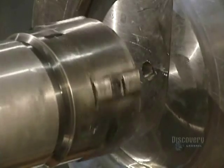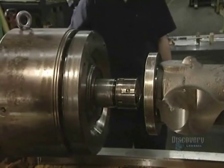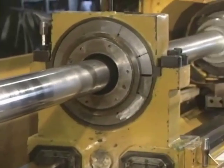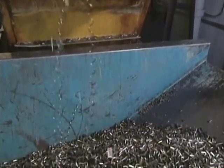They're now going to pierce the shaft. This drill head will ream out the inside of the shaft. Alignment of the head must be perfect, so they're cautious with their work. The perforating gets underway. Turnings from the cutting are saved and will be sold to foundries where they'll be recycled.